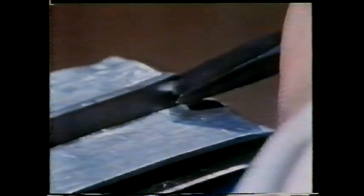The chisel is heated to a much lower temperature than that used for hardening — in this case about 280 degrees centigrade. The chisel is held at this temperature for about two hours. The surface of this chisel has been polished and, at this temperature, appears purple in colour. We now quench in oil. This time we have a chisel that's hard enough to cut, but not so brittle that it breaks. Tempering has removed some of the brittleness, which makes it tougher.